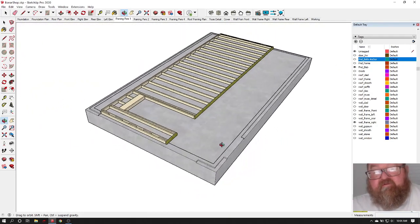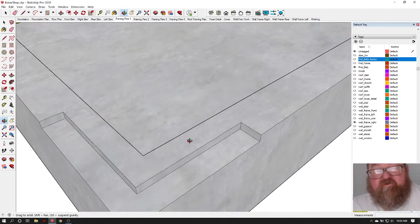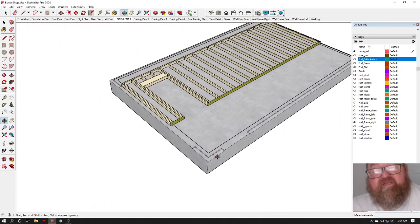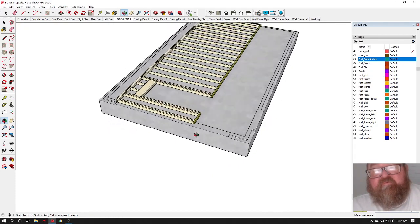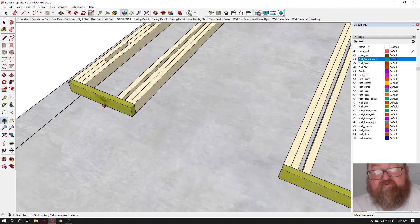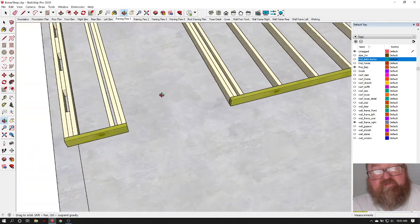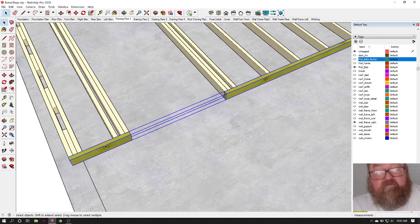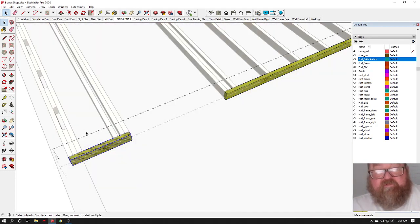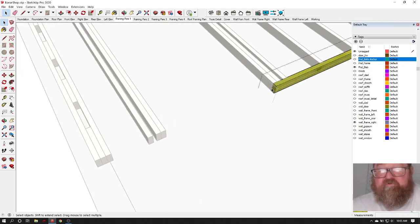Okay, so we got our line popped here. This would be a blue or red chalk line, not black like that. But so the first thing you want to do is lay out, and what I'm going to do is show this plate for now as one thing, because when you first build your wall, you would want this plate to come all the way through.